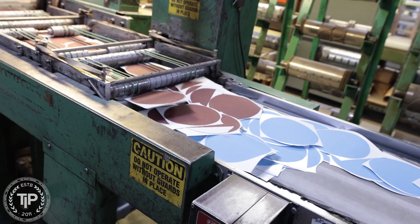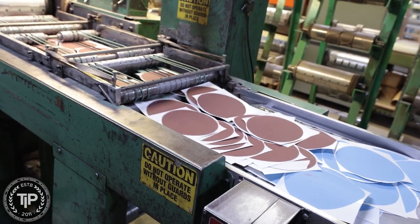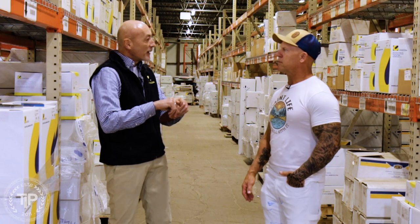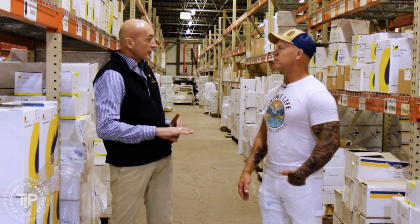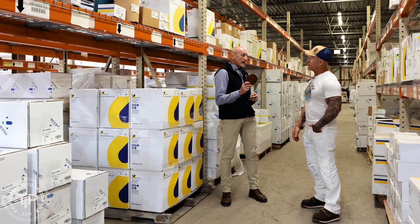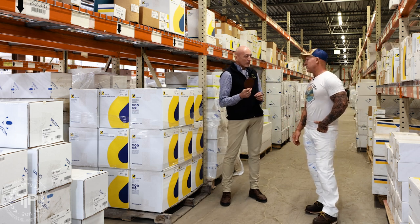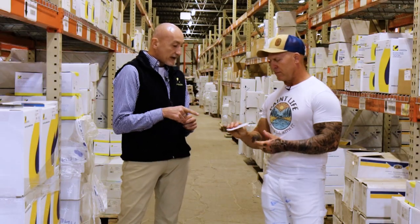Nothing's going to outlast cloth because of the durability. The problem with cloth, though, is that you can't see it looking at it, but it's just like a pair of jeans — it's woven. So every time a thread goes over another thread, you're creating a little bump. Anything you do in sanding will feed right through and show up on the part. So although you get good longevity, the finish typically isn't real good. I wouldn't really recommend cloth for too many applications in your customer base.